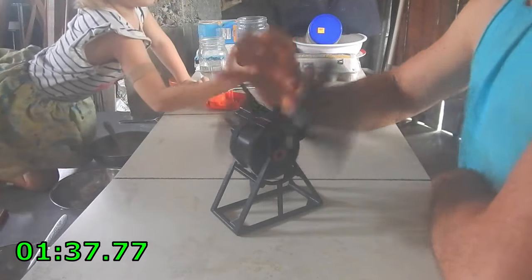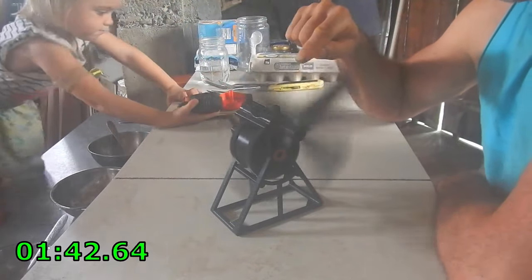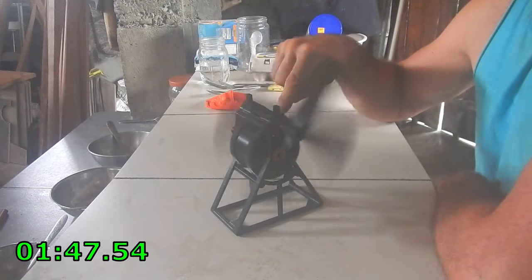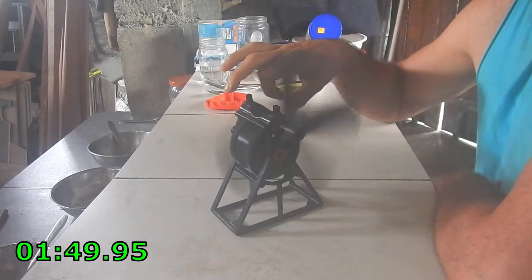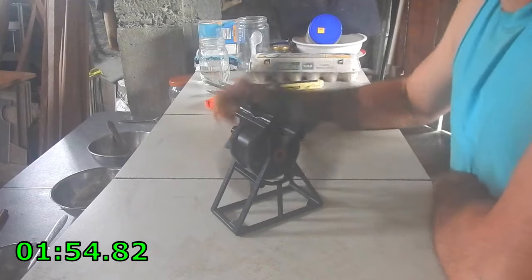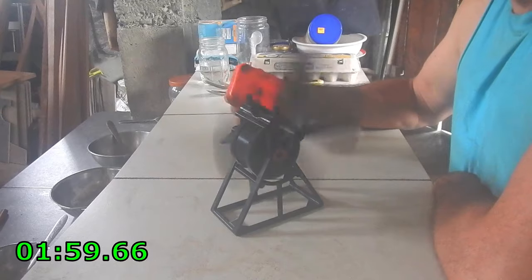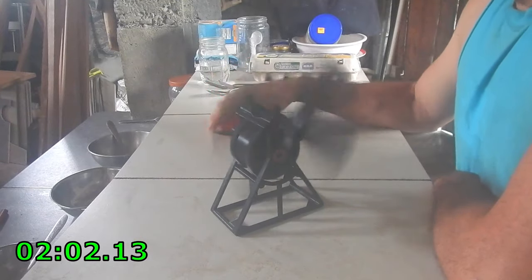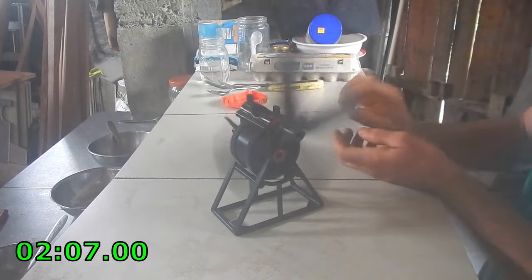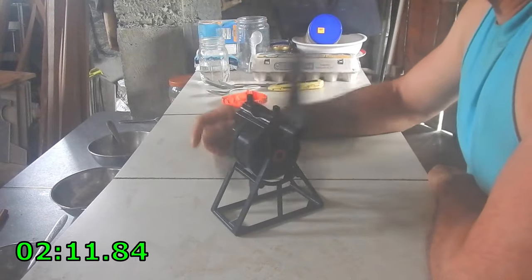Oh, is there anything else? So, most of the parts here are 3D printed, obviously. The non-3D printed parts are 5 skate bearings, just standard size skate bearings. I wanted to use something that would be easy to find for anyone. And then the spring out of a tape measure. You should be able to use the spring out of pretty much any tape measure because of the way it connects. I used a lighter to anneal the end of the spring to bend it to lock in there. And I'll show how all that works.